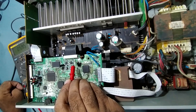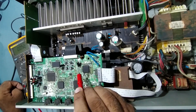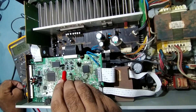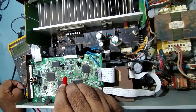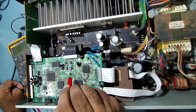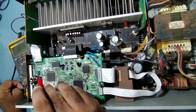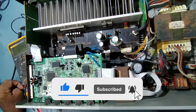The voltage here is good and here the voltage is good. But there are two DC-to-DC converter ICs — from this Schottky diode and this coil, 1.2 volts should come, and from this Schottky diode and this coil, 3.2 volts should come. Both voltages go to the DSP IC and some small audio and digital ICs.